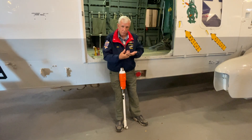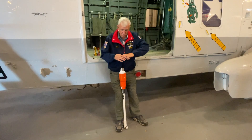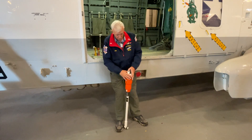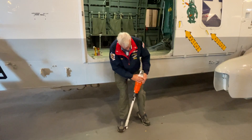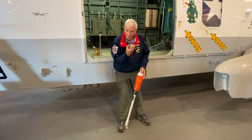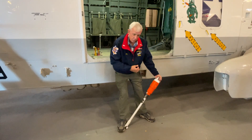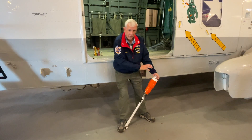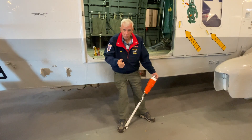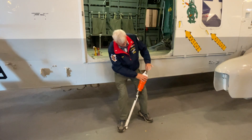This is a hydraulically actuated holdback bar. How this works is that the F-14s and the F-18s, instead of having a holdback fitting that you put something into, get launched by the nose. There are these two fingers — if you go on the F-14 up on our flight deck, you'll see these kind of spring bushings there with these fingers. What happens is you take this holdback bar, pull that down, and you'll see it's got sort of an arrow fitting. Those two fingers fit in here, then this slides over it, effectively locking those fingers so the aircraft can't go anywhere. When they move it up to the flight deck where the catapult is, this will lock into the deck and everything is locked in place — the aircraft can't move. When they push the button to launch and the pressure would have been enough to break one of those torsion bars, this center section slides forward slightly, releasing those fingers, and the aircraft goes.